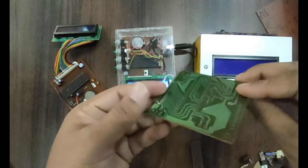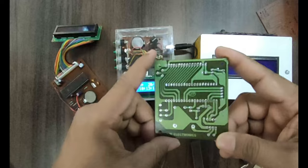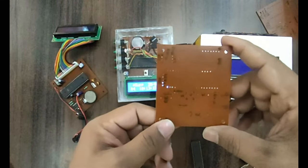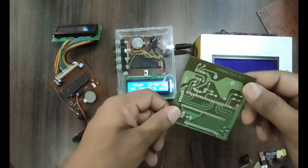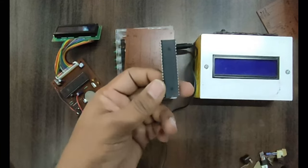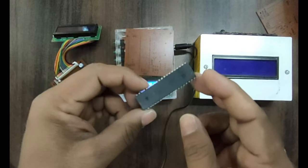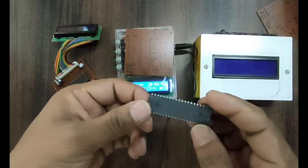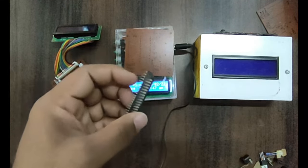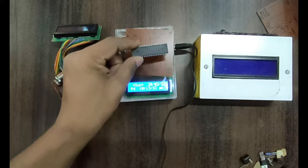So I've got one PCB board which I have already designed. The details of the circuit diagram for this PCB board will be mentioned in the last slides of the video, or in the description below. To build this digital clock, you require the heart of this circuit, that is a microcontroller. Here I have used the 89S52, or you can go with the 89C51 or 52 microcontroller. Obviously, you need a hex file of the program to burn it. You will get a hex file in the description below. You can download it easily and burn it.